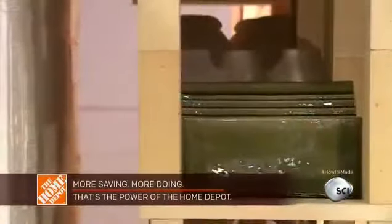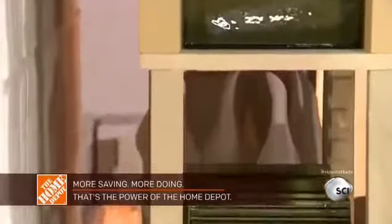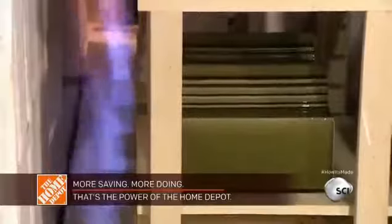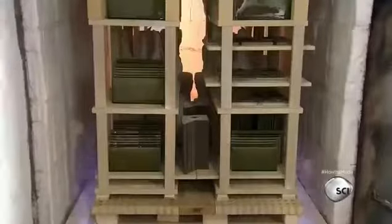The glazed mantelpiece and tiles now go into a gas-fired kiln for 12 to 14 hours. The high temperature, 2100 degrees Fahrenheit, triggers chemical reactions which harden and strengthen the pieces. The clay's mineral composition transforms into a completely new configuration of crystals and glass.